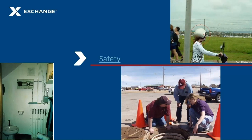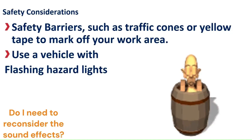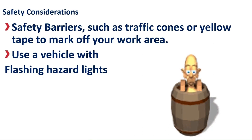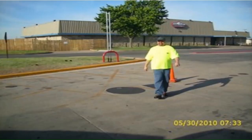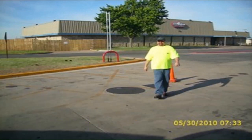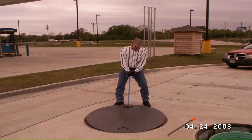The driveways and parking lots of gas stations are dangerous. Be safe. Wear bright highlighted safety vests or clothes. Inspecting with a partner can help you stay safe — one person to watch traffic and customers, and one to do the inspection. Use a vehicle with flashing lights to block traffic, especially in a high traffic area during a high traffic time of day. For example, rethink inspecting a tank pit in the Burger King drive-thru at lunchtime. This is me at a gas station with my bright yellow shirt and big orange pylons — that pylon has been run over by a customer, and not just once. This is why I recommend using a vehicle to blockade traffic and inspecting the tank pit during deliveries.